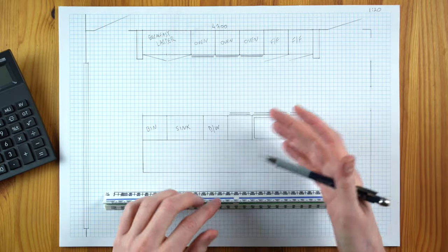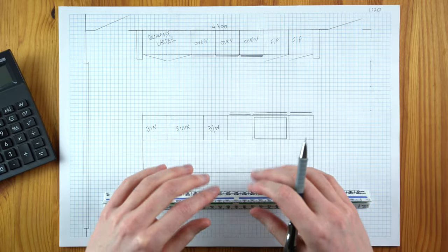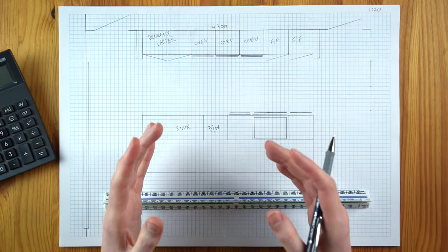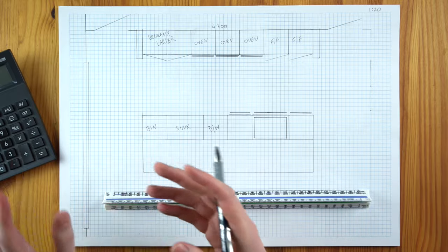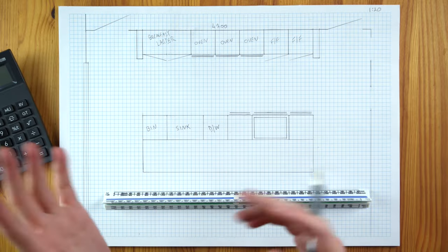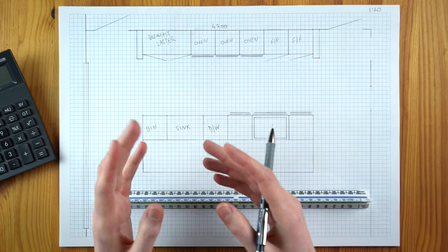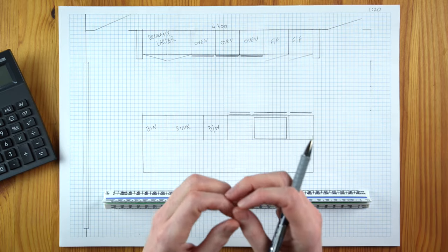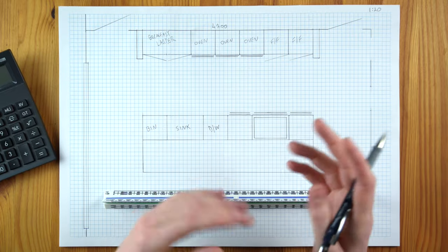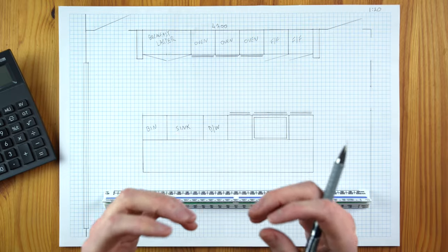The clients have talked about a venting hob — an induction hob with a built-in extractor. Because it's a new build, the builder can get the venting in place ahead of time so it can be extracted outside. If that's not possible, a flush ceiling cooker hood vented out through the ceiling would work. In the UK on a new build, you do need some form of extraction to outside to pass building regulations, at a particular power depending on placement in the room.